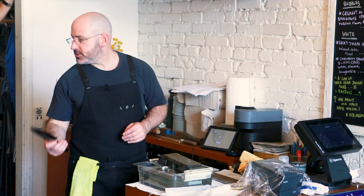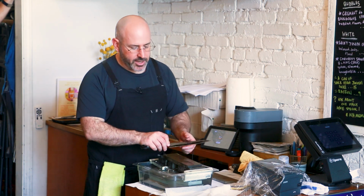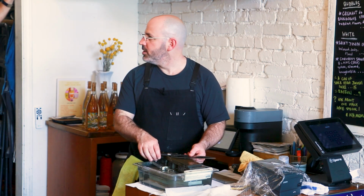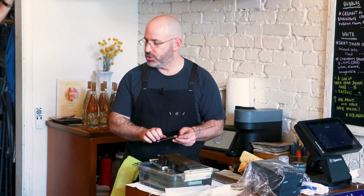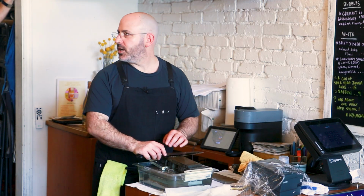So we've done our first side. We're going to start again from the pinch grip. We're going to move our index finger to the spine, thumb to the spine, index finger down towards the heel, and we're going to start sharpening again. Here, I can't use that same angled approach in the beginning because the handle gets in the way. So that's why some people choose to switch hands. I don't, so instead I start off perpendicular. Otherwise, the concept's the same.